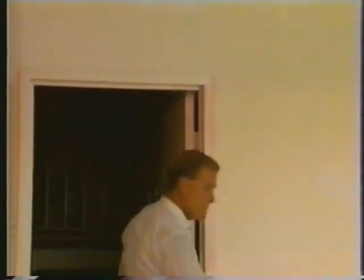Painting window frames, doors, and door frames is next. Baseboards, however, are left to the end. Once again, don't worry about the trim paint getting on the wall. You're supposed to do it that way. As always, use lots of paint and a good quality brush to give you a smooth finish. To paint raised sections of trim really quickly, pat the sides of the bristles along the raised area, then smooth out the paint evenly.